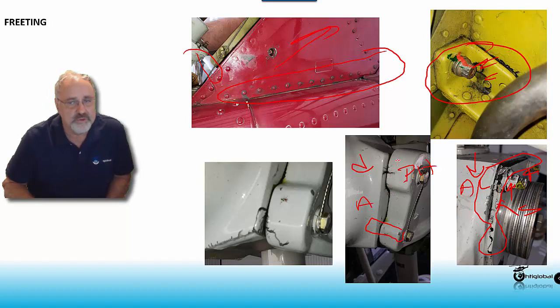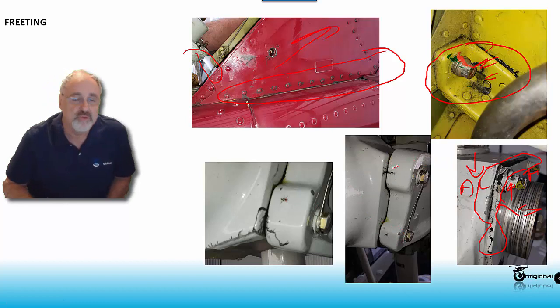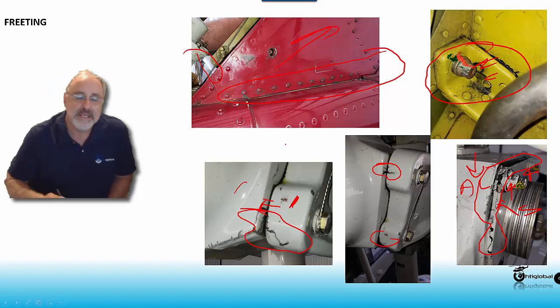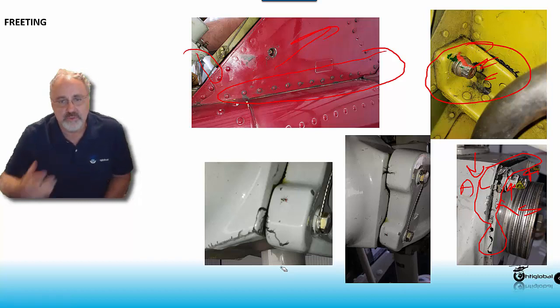What I'm saying is that whenever you're going to remove the pitch horn, it's going to be very hard. What happens is some customers or mechanics like to install the pitch horn with CPC Grade II or Mastinox, and when you do this, you are provoking freedom of movement. Look at all that black stuff coming out — it's telling you that the pitch horn is loose, not properly torqued, or it's already moving inside, and maybe the bushing hole is already worn out. All this is a critical part, and using the wrong product is a human error. This is a problem.